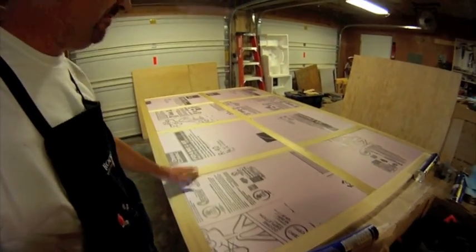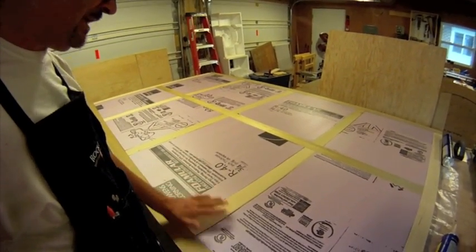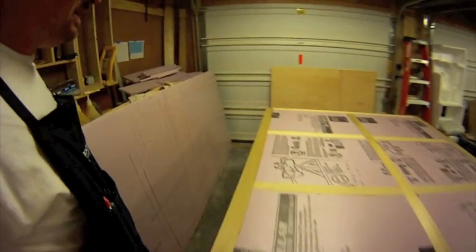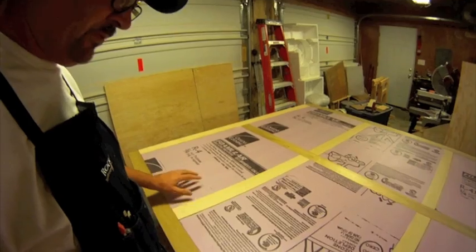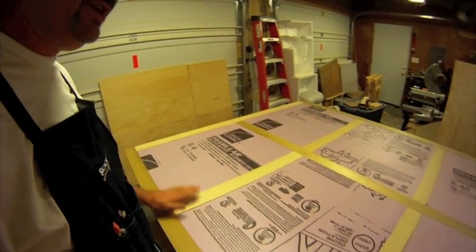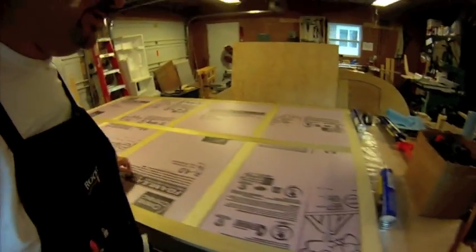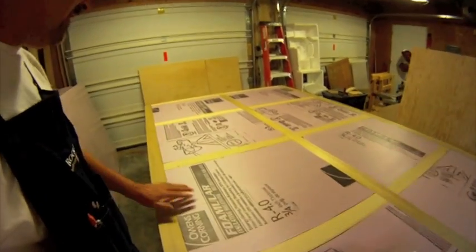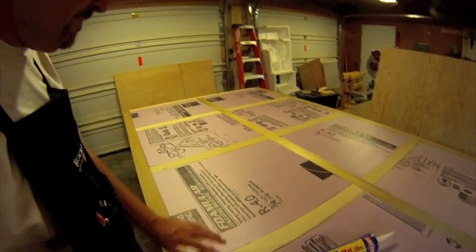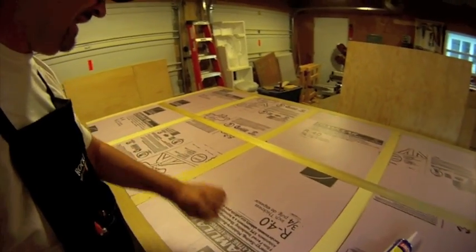I've got the grid all made here, the supporting frame, and I've also got the foam all cut out and in place. So now I'm going to glue the panels on, and remember these panels are 1/4-inch marine plywood. Now for this one, I'm not going to worry a whole lot about getting complete coverage with the glue. I'm going to use the PL Premium again, and based on my experience doing the sides, it's a real job to get complete coverage and get that all troweled out.